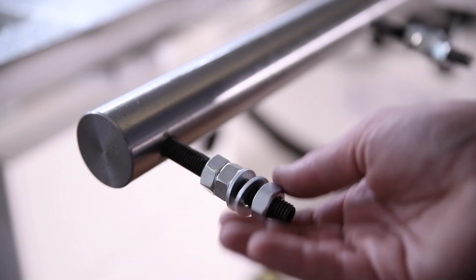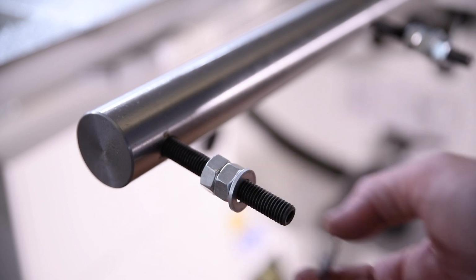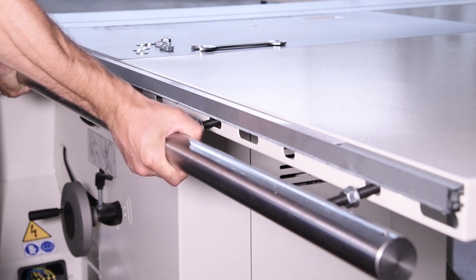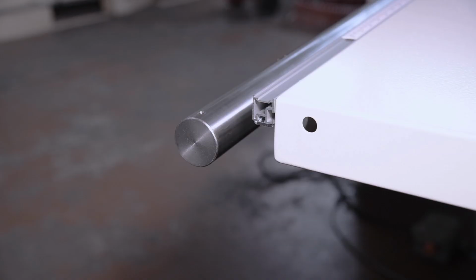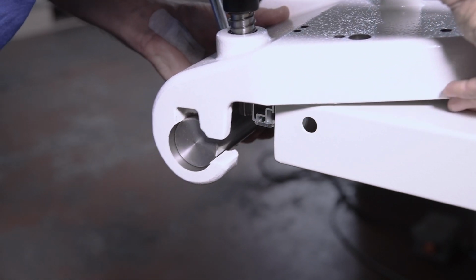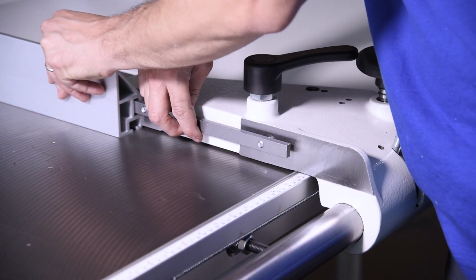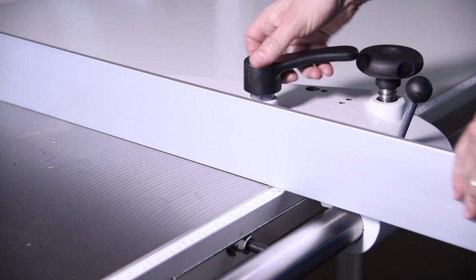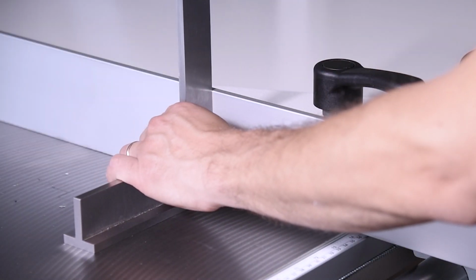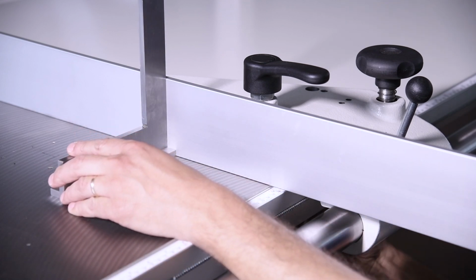After you install the scale, you install the rip fence bar. Loosen all its hardware and mark the location of where the washers go. Hint: the ones on the cast iron side are spacers, which are more precise than standard cut washers. It is best that you keep these where they belong so you can return to the factory settings. Once you have it set in place, install the fence knuckle by removing the safety stop bolt on the end of the bar and then sliding the knuckle onto the bar and installing the fence itself. Then tighten things up while checking for square.